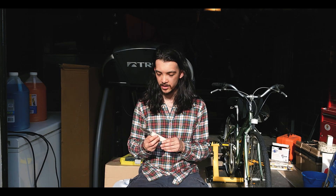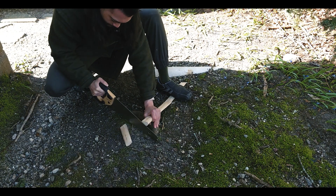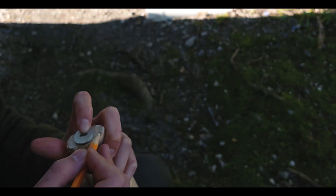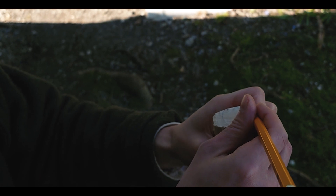I'm going to my garage. I'm wearing modern clothes at the moment because I'm dealing with a lot of sawdust, and in a second I'll be dealing with some dyes and boiled linseed oil. The wood I'm using is a piece of maple from my front yard — I originally tried to make a bow out of it but the stave broke, so I'm repurposing it. With this knife, the plan is to just do a friction fit; I'm not going to worry about epoxying the blade into the handle.